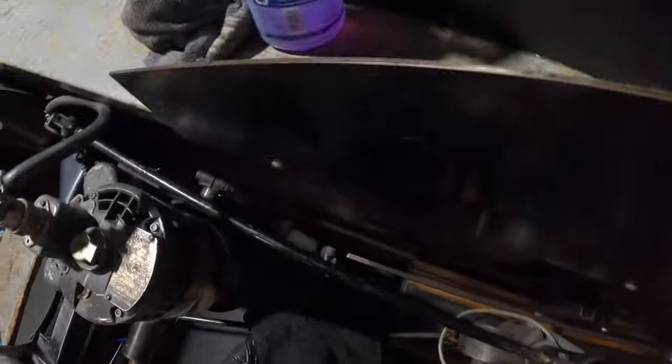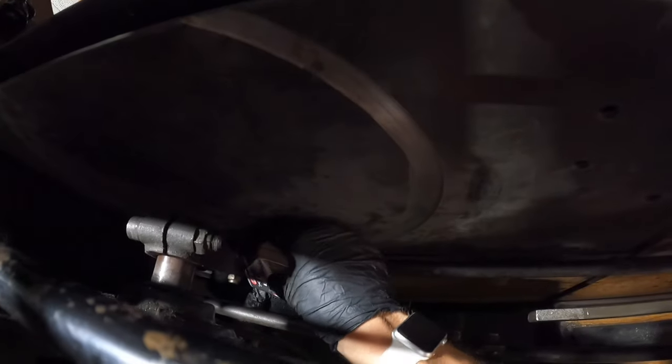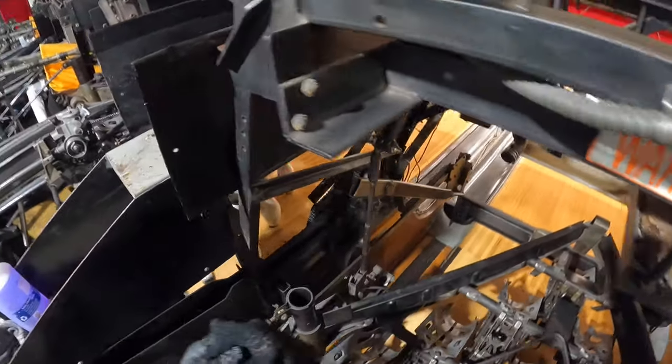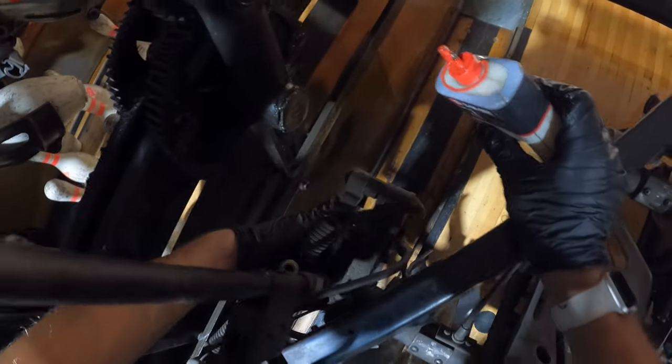You can get this sweep rod right here. Now it's got some nice oil on it. Oh, we got to get this one right here. These tables get really dusty — you've got to get the lower ones, we forgot all the lower ones. Basically you just want to clean, inspect, and grease.